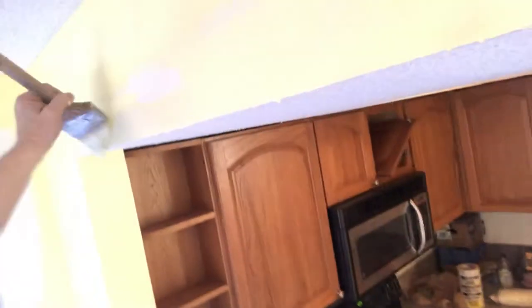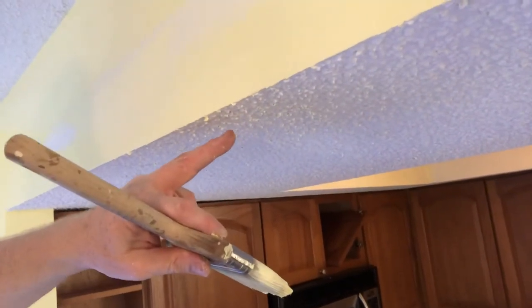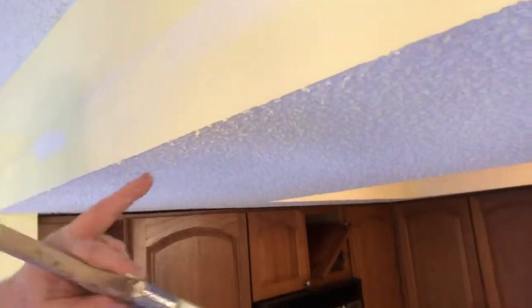And that's really all there is to it. Check what I'm saying. One last time I'll show you up close. You're taking the meat of your brush and you're pushing it. You don't want to drag the brush up because that would cause the paint to pull up right on the edge and it would go on there. That's why I want you to start the brush up here, and then when you're sufficiently dry, you bring it down here. Can't fail.